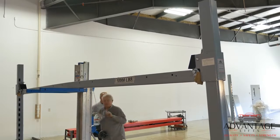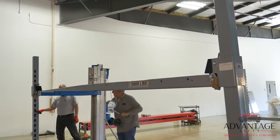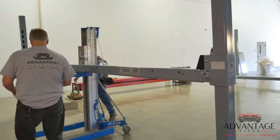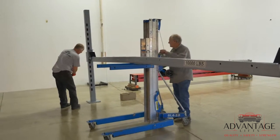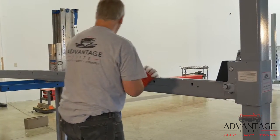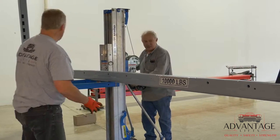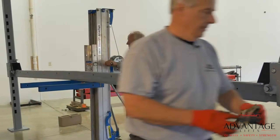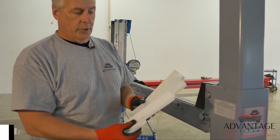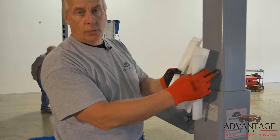We're going to go down till we get to the seventh lock: one, two, three, four, five, six, seven — and that's where we're going to set it. We pulled out our cardboard so the locks will engage into the post. We'll keep the genie underneath here until we get the sliders in so everything stays nice and square. Now by using the genie it keeps it nice and level so it comes down without scratching up your post. You can guide it to make sure your post is in the middle of the bucket as it comes down.